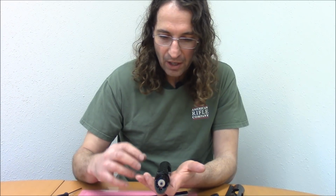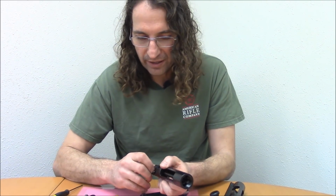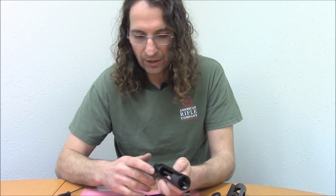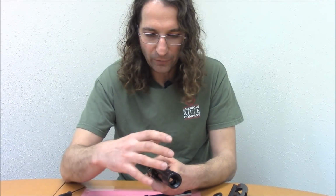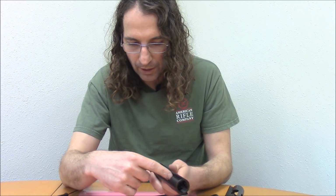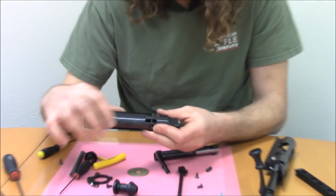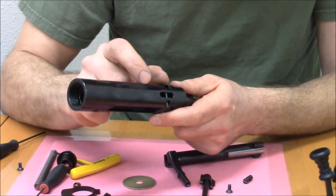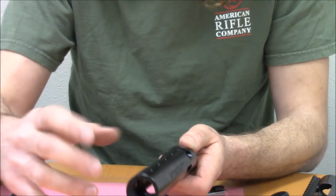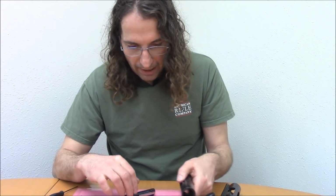The other thing we don't do, a lot of people ask for a right bolt, left port. I won't do that in a field action. I might consider it in a bench rest action because those guys generally control conditions pretty well. But in a field action, I don't want to do it. Again, I don't want to put a gaping hole in front of your face. The ejection port is just too big a hole and it extends too far forward to the chamber. We have the ejector port on this side. I'm much more comfortable with that, A, because it's small, and B, it's much further from ground zero, where the pressure is, which is up in front in the action. So that's that. And what else do we have here?